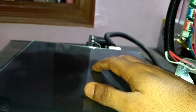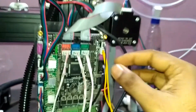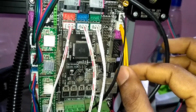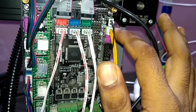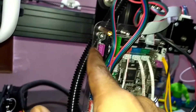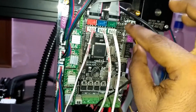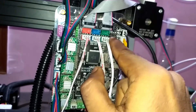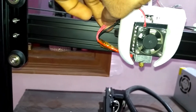For the heated bed sensor wire — these are the two yellow wires coming from your heated bed — you connect them to the point just below the extruder sensor connection. At the bottom you can see a purple color port. As already mentioned, if you are using a second extruder, connect your extruder motor and sensor wires there. Black is for extruder number one, purple is for extruder number two, and white is for the heat bed.